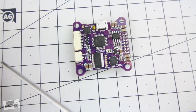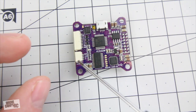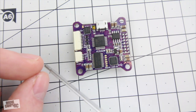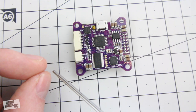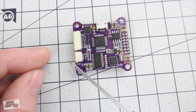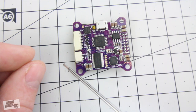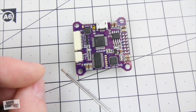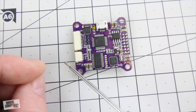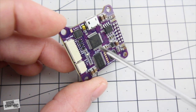If you get a VTX from another company whose connector doesn't match this port, all you have to do is cut the cable connector off the VTX and solder it directly onto the wire going into this terminal. For those of you who are new and get frustrated when connectors are different — just match up the black wire, the red wire, and sometimes the yellow wire for your video signal. The RSSI port is here as well, though you probably won't use it.